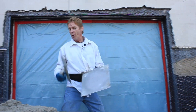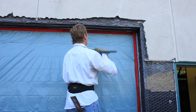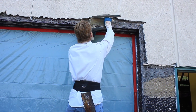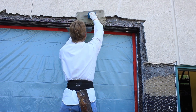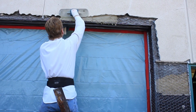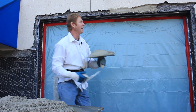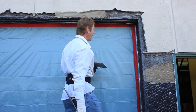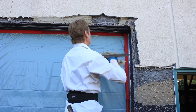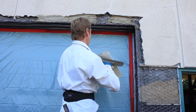Now I got some mud that we have with no retardants in it, and we are going super thick here. What does that mean? That means it's going to have a tendency to want to fall, because typical mud is not made to go that thick. This is an easy part to my left. Let me show you the difficult part to my right, because that requires a lot of stucco — that's why I say it is difficult, because it's so thick.